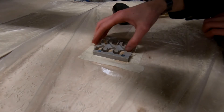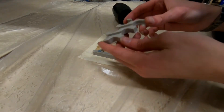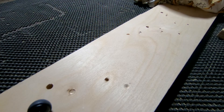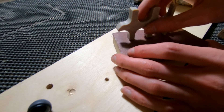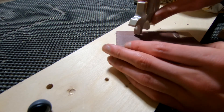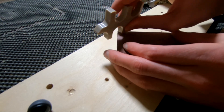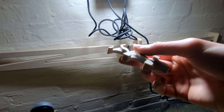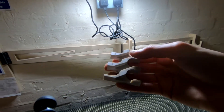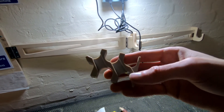So let's get this out of there. Okie doke, so that is the test part complete. The main learning point is I don't actually need a finishing pass, so I can get rid of that and maybe make the tabs a little bit bigger.